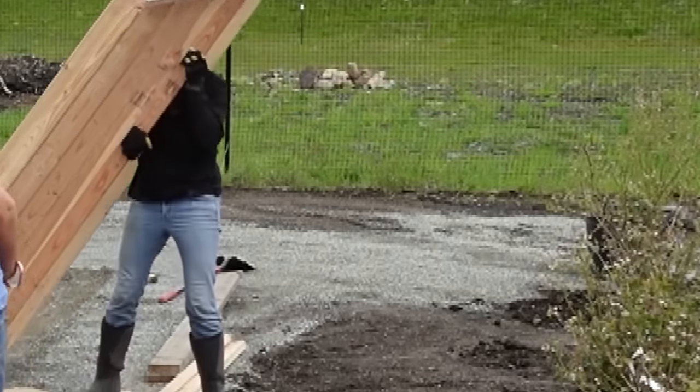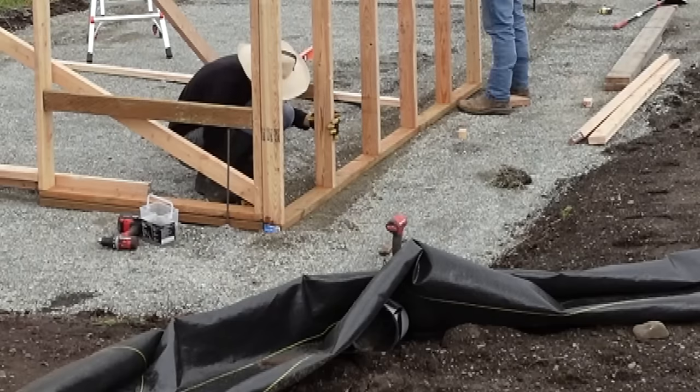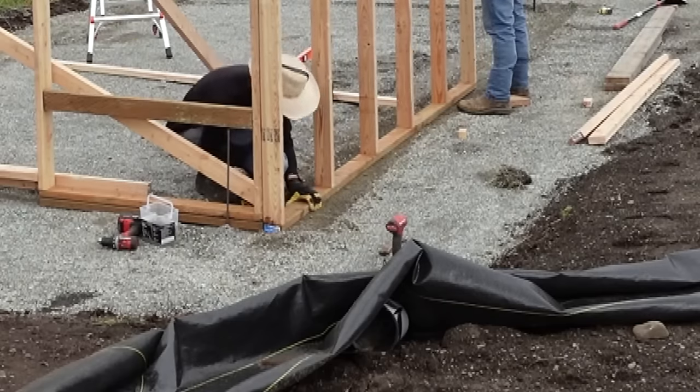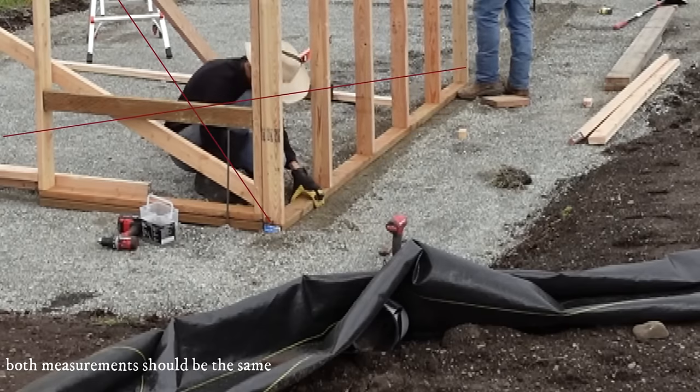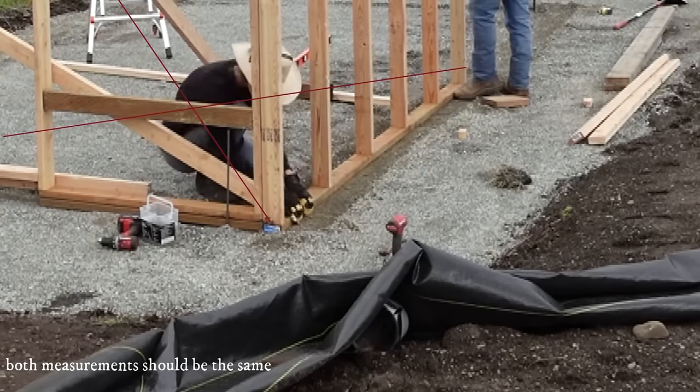the front wall to the side wall, and then we put up the second wall, and we made sure that was completely square, so we diagonal with our measuring tapes across each way so everything was squared up, and then we added our other walls.